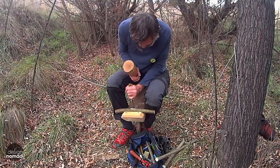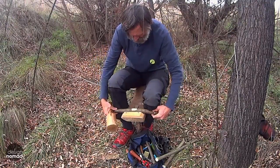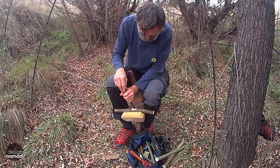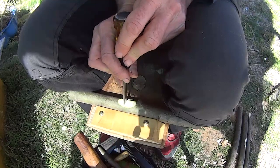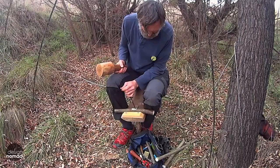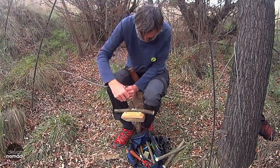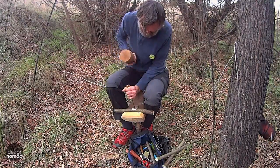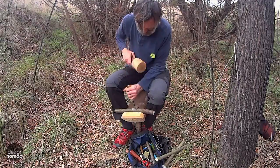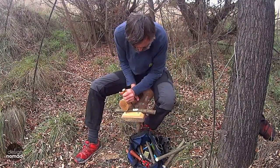So the second cut marks the other end of the mortise hole, like that. If I turn that one around, roll towards you. There we go. So I'm going back 2-3 millimeters, and just lining up with the grain. It's not really critical. And I've pumped that in there like that. It's taken that little piece out back to that first cut. And the next one, let's use my thumbnail to push that into place. Chop. Once we get this first row in, it'll get much easier. Just wanted to roll away from you guys, you can't see it. Put that into there like that.